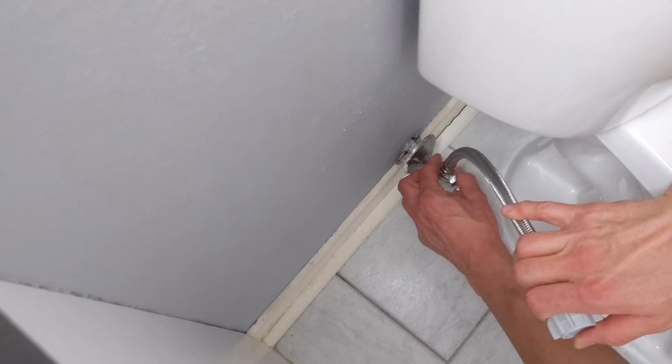And lastly, the most important part is to install the toilet seat, and this also comes with the hardware. It's just a screw, washer and a plastic cap that's going to be used to secure the seat into place. So what I'm going to do is it's already got a bit of a rubber seat there. So I'm just going to line this up over the holes, and I'm just going to take my screw off. Okay. And like so. And I'm just going to drop this through. And same thing with the other one. Okay, and this one's going to drop through.